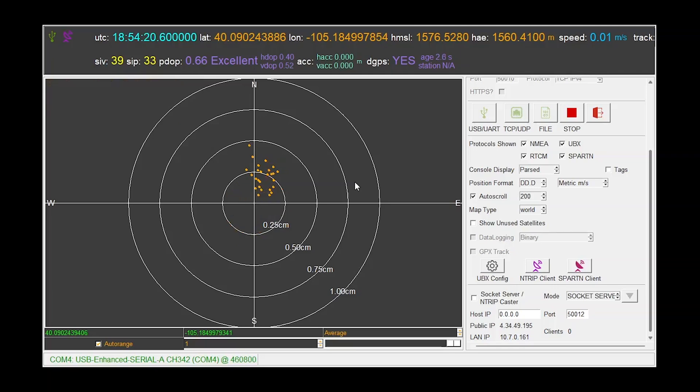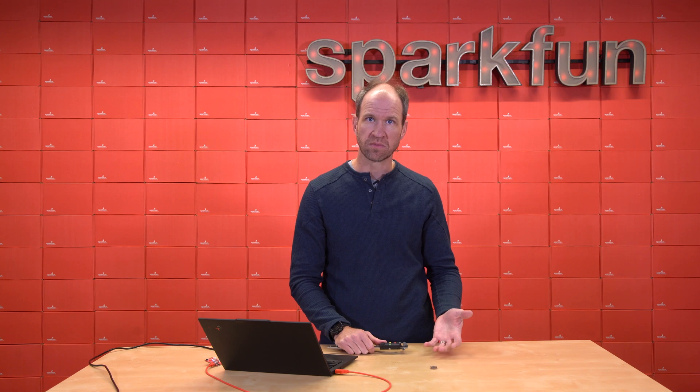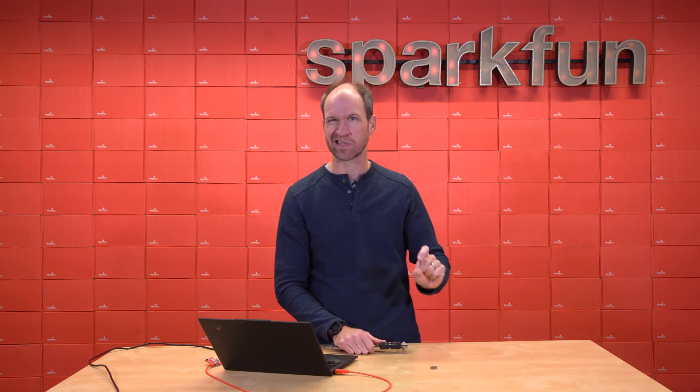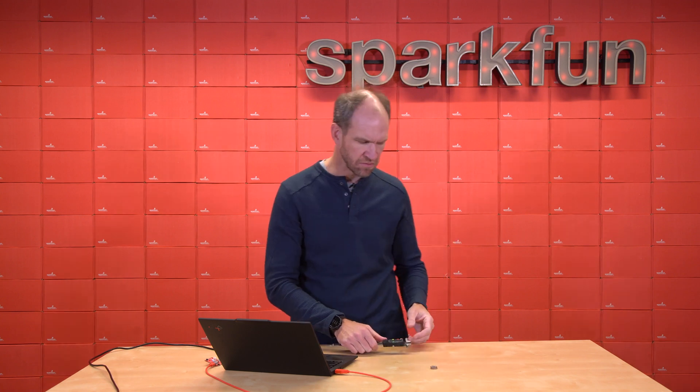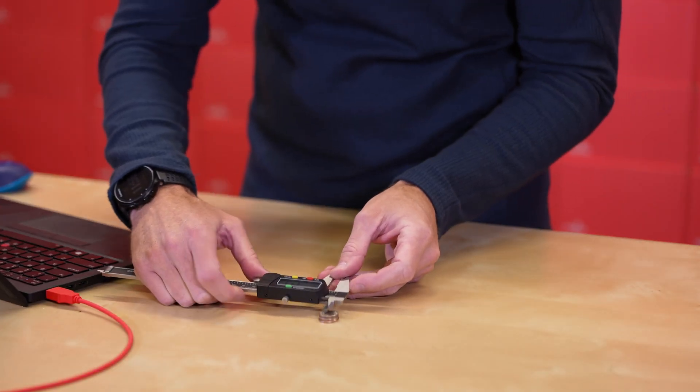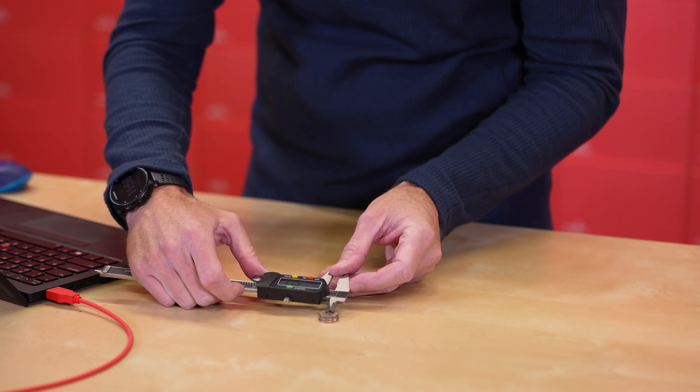Looking at the software, we can see the data on the scatter plot, but it's kind of hard to visualize that in real life. So today I've brought in a stack of five dimes. Dimes are approximately 18 millimeters in diameter, and this stack is about six and a half millimeters tall. So when we're talking about an inaccuracy of eight millimeters, we can literally start to measure the distance between some of the letters on dimes to show us — this is eight millimeters.